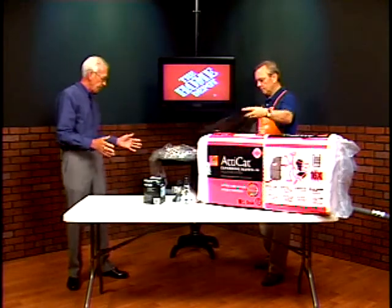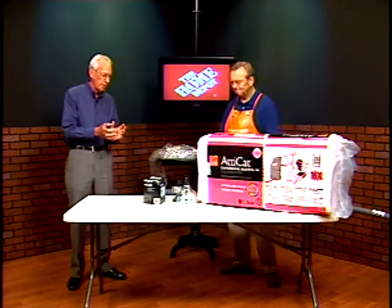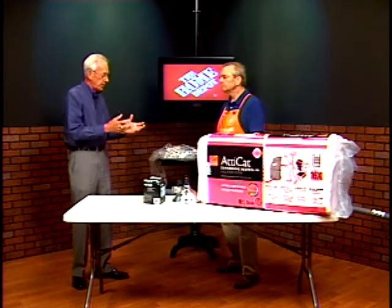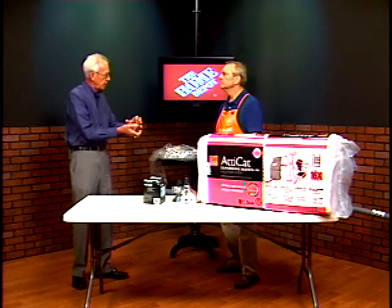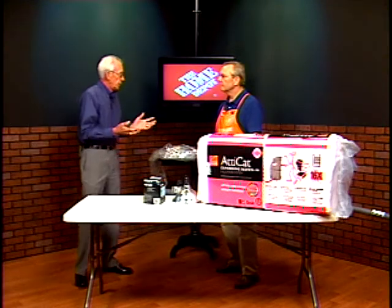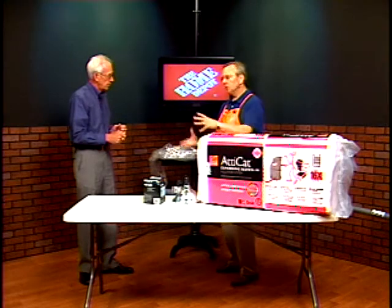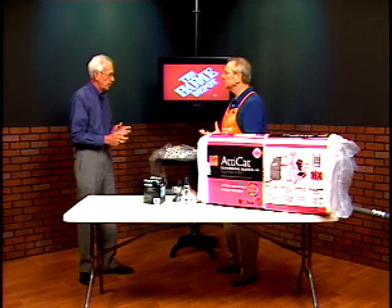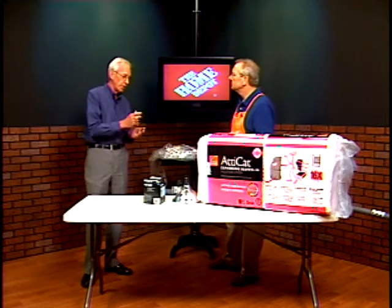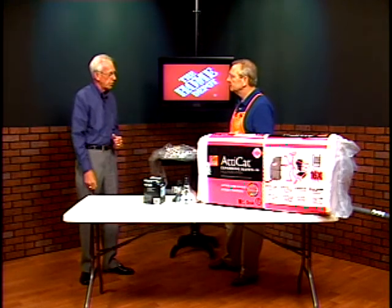Some of the things people worry about are the faucets on the outside of the house. They do make a foam boot — a glove that goes over that spigot or faucet — to keep it from freezing since it's exposed all the time. They also make frost-proof fixtures, but those don't work as well as just putting the foam boot over. We sell those at Home Depot for $1.98. You can still take it right off and put it right back on. One of the worst things you can do is leave a hose hooked up to it — water will lay in that hose and you'll end up with a busted hose bib on the outside.